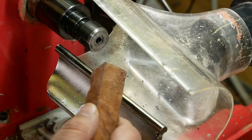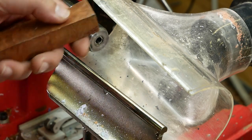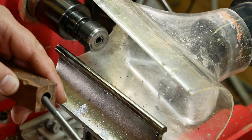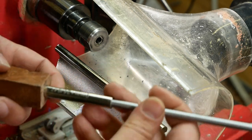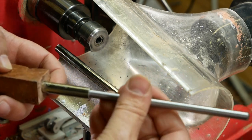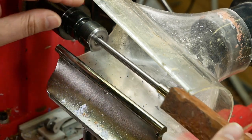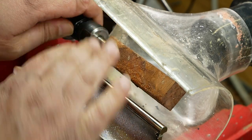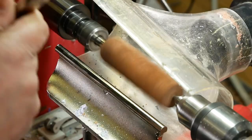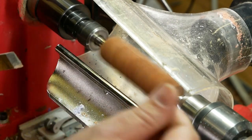And here we have our blank drilled and the tube and plug glued into place. We're going to have to trim, but we can't use a barrel trimmer. It won't fit. Instead, we thread the mandrel into the internal plug inside and insert the 10mm barrel trimming sleeve. The sleeve sticks out, which is good because with that gap, we will be able to have access to the end that we need to trim. Hand tighten the collet. We don't need it super tight. Bring up the tailstock. Now we cut straight in and carefully remove extra length until the end is flush with the tube.